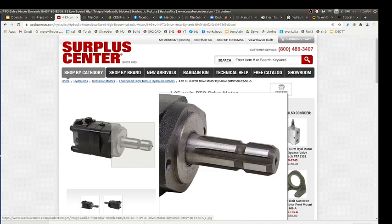And that's exactly what we did. We put a metal plate with larger bolts, because the bolts there are kind of small and not that accessible. You have to have a nice tight coupling. So we put a half inch plate on it with big bolts, and you have to remove two bolts to use the motor on another implement, which is easy. Or you can have some other kind of quick connect. We haven't really done quick connects, but on our tractors we've migrated to the Bobcat quick attach, meaning the levers that you pull apart and then the implement comes off.